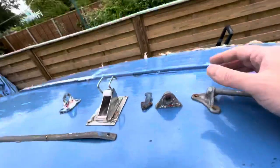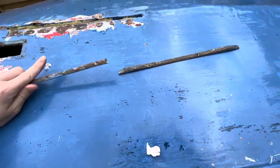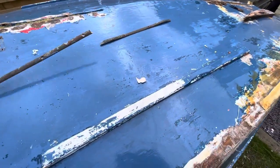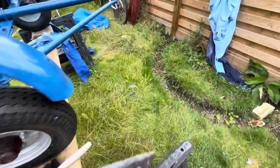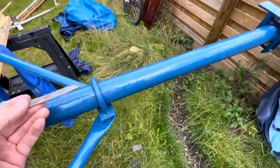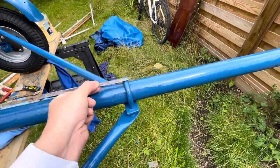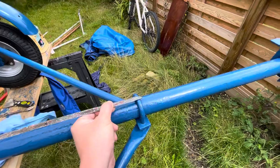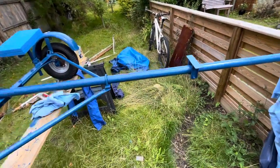I've got the original hull fittings here — I've taken them off. The biggest problem is with the keel band. I'll show you the loop on the trailer. This bit of the keel band has been worn into two, and that's where the keel band sat on the trailer. What's happened is that it's rubbed at some point during a journey — it's not been mounted high enough on the trailer. So we need to do something about that, and I'm going to show you the restoration of this old snipe trailer in a later video.